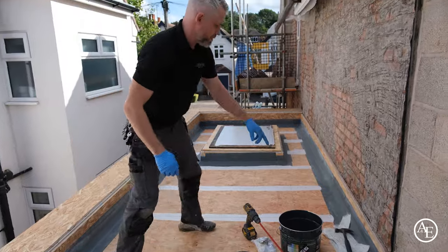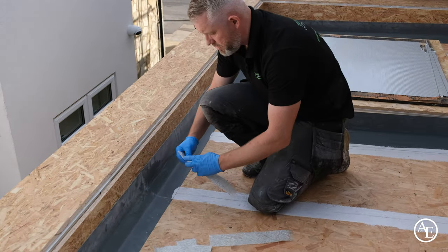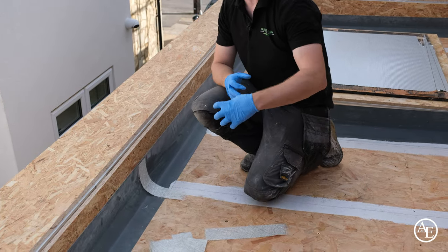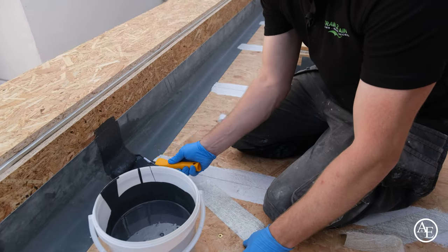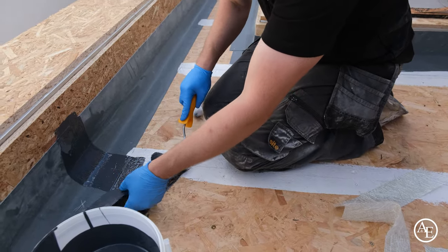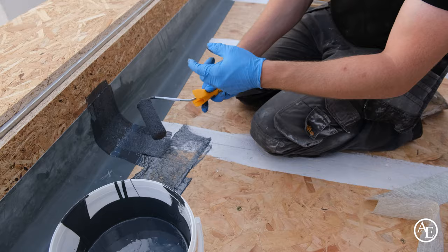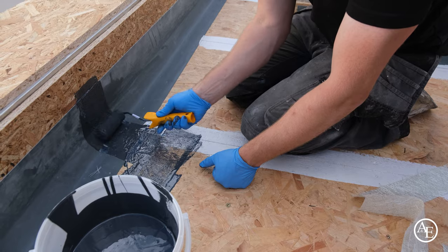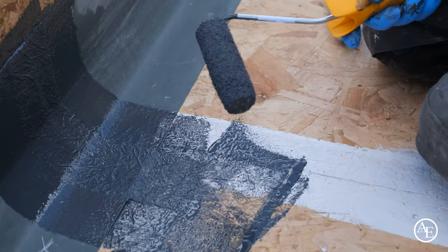I've pre-cut some strips. Where we've got a joint, we're literally going to put a bit of resin up the wall, put these strips into it, and then a bit more resin over the top — we're looking for a swirly pattern. You can dunk your roller, coat the area, and put a fair amount on. The better way is to coat both sides so the styrene in the system breaks down the glue on both sides of the matting. Run a little bit more resin over the top and run any excess into the actual trim itself to avoid sanding later.